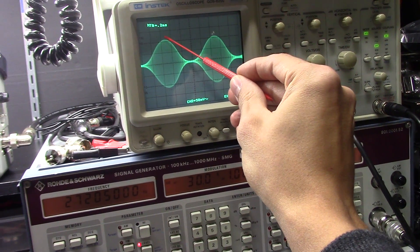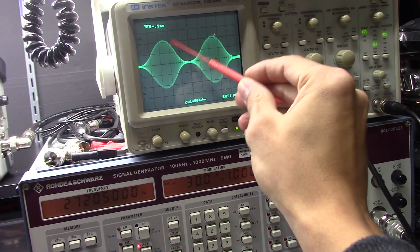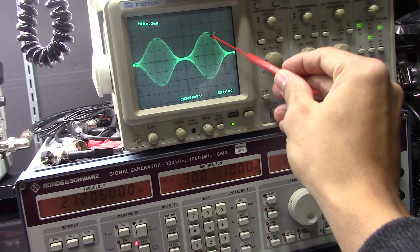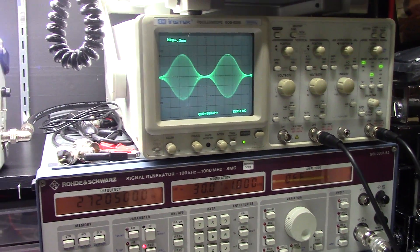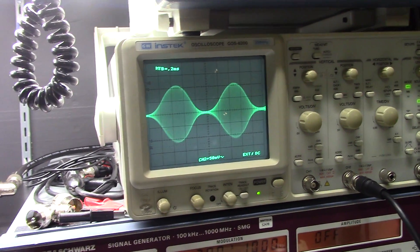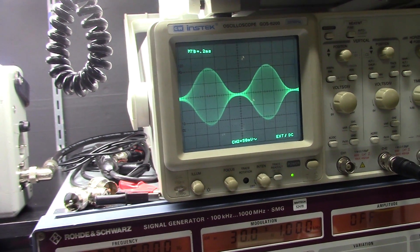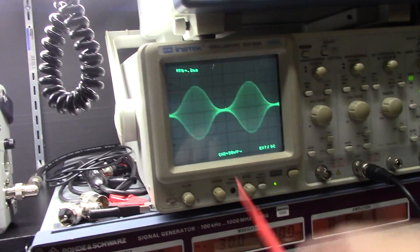Really nice — positive rounded on the top, negative rounded on the bottom. That's what you want to see. If you crank it all the way open she's going to shark tooth — it's going to clip and pinch. A lot of people will say 'oh that's a great looking waveform' and somebody's probably thinking, well yeah if you say so.